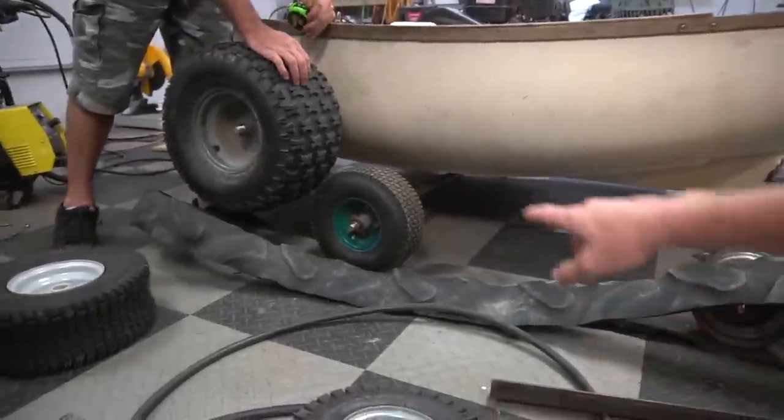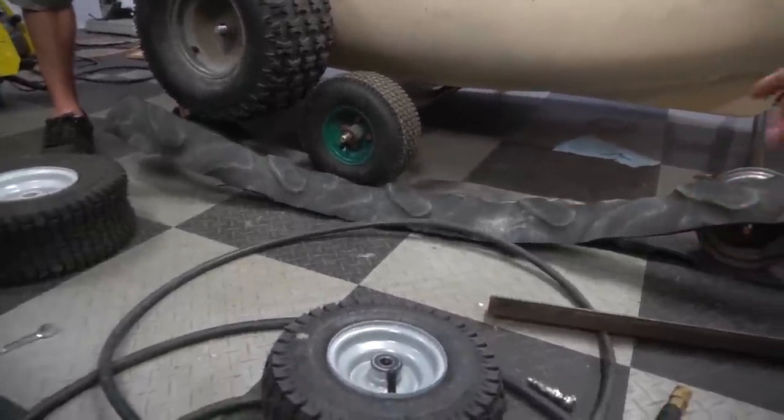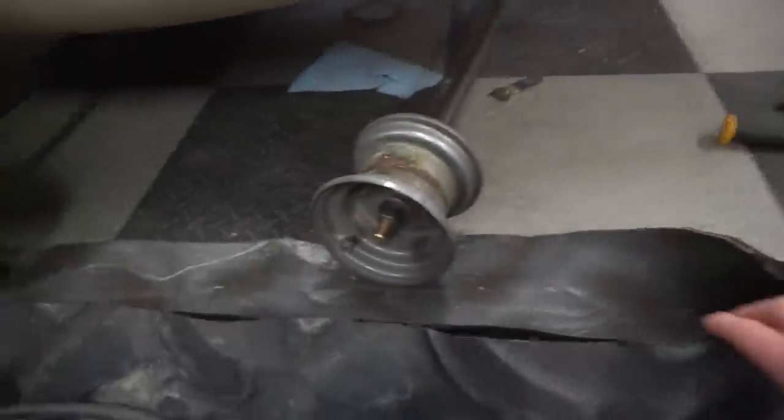So here's the deal with the tank tracks. We're gonna have two wheels down here, and that's like the surface area that the track is gonna be touching the ground. And yeah, no, we know it looks like a piece of spaghetti. We were hoping it would be a lot wider than that, but we were limited in what we had with wheels. Another issue is that if we had really, really wide tracks on here, we would just really overwork the torque converter and overwork the engine. And, well, we could have geared it too, but there are a lot of unanswered questions you guys probably have. We probably spent like 4 hours maybe today just kicking stuff around, and we figured this was the best way we could do it.